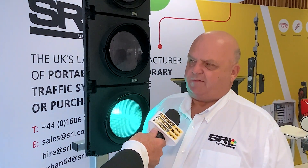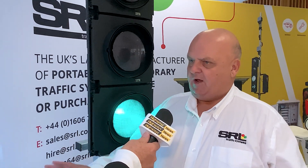A lot of people like to move away from overhead cables, but during construction, above seven meters height is classed as a safe area. Our Urban 64 system has poles that go up seven meters — the traffic signals are at standard height but the poles are seven meters. Catenary wires are put across with cables tied across at 48 volts, whereas a typical LV traffic signal site is 240 volts in the ground, which needs to be isolated before anyone starts working there.